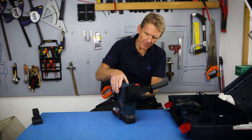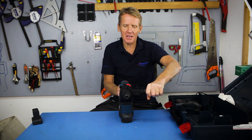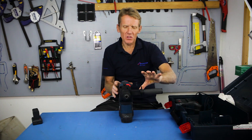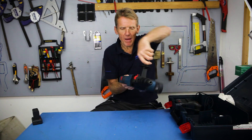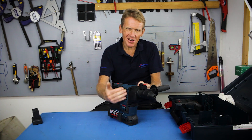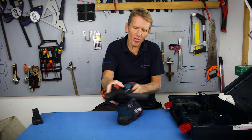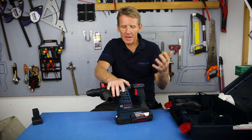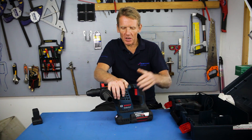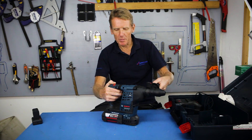The other thing they've got is a kind of electronic chuck protection. It's a little sensor — almost like a pendulum switch. If you're using the drill and it happens to snag, there's a tendency for the body to want to turn rapidly. If a lot of sudden rotational force is detected, it switches off the motor straight away. The only way to switch it back on is to release your finger from the trigger and then repress it. That's a good thing — it saves you having your wrist broken or wrenched. I've had that a few times when drilling into masonry and it's stuck.